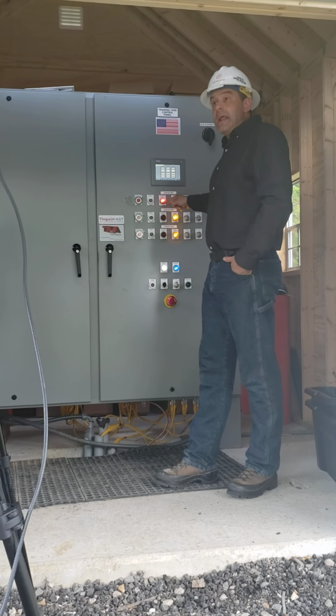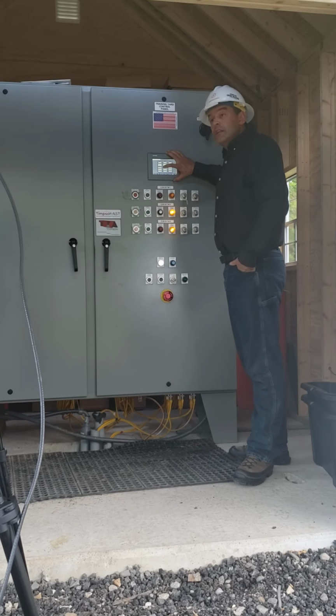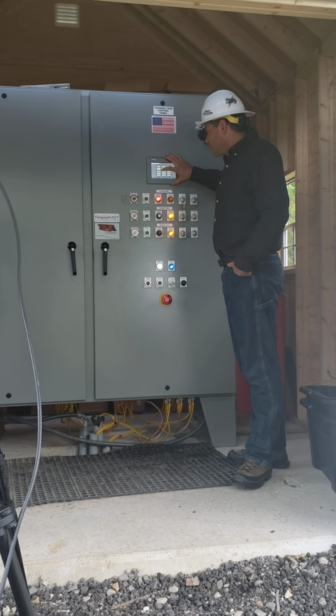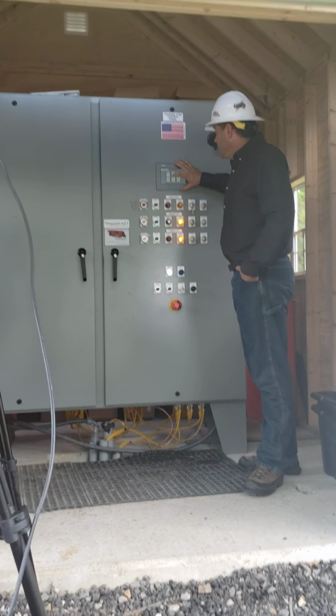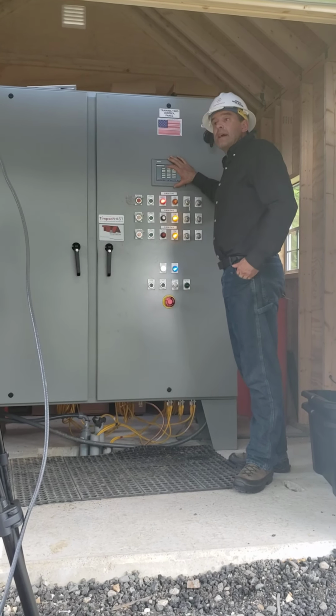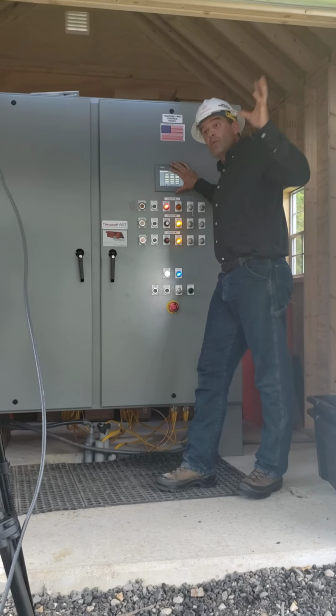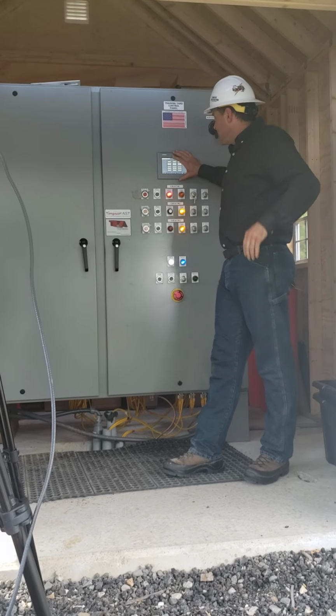This circuit is now energized, and I can confirm that it's energized by looking at the current quantities for circuit 1. Currently, it sees A phase at right around 49 milliamps. That current quantity is a reflection of the fact that we've got some transformers installed on that circuit.